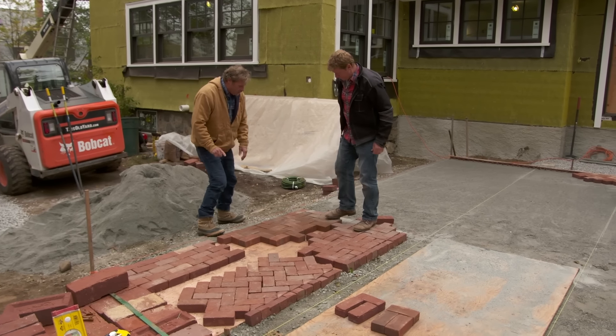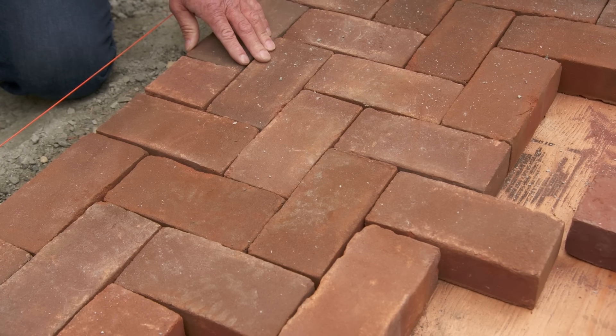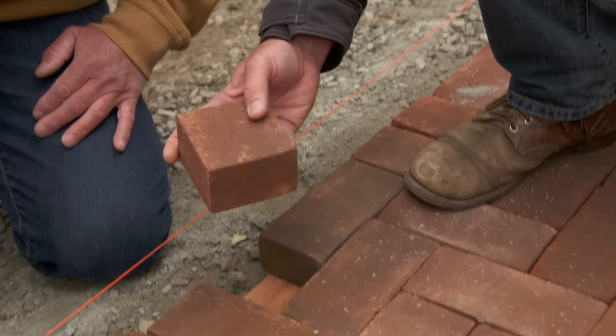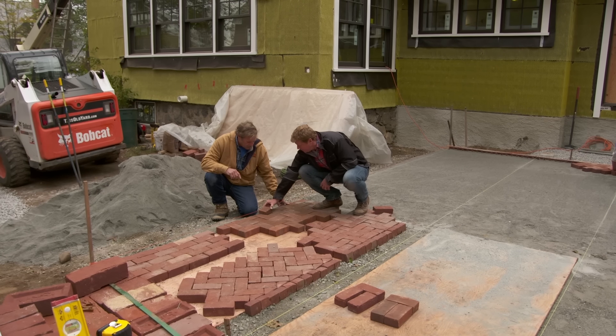What they liked was a herringbone. So this is a herringbone made out of modular brick — not the S&H pavers. You can see how tight the pattern is and how few cuts there are involved. This is a cut right here and because they're modular, when you cut that brick it's actually in half — you can use both halves.